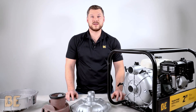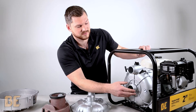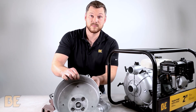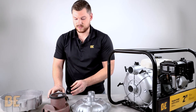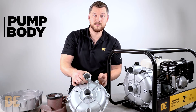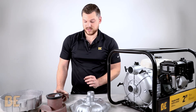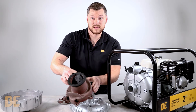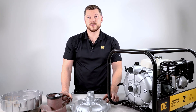Semi-trash pumps are designed to pump large volumes of water that may contain rock or debris, and can be easily identified by the black t-bolt handles that hold on the front pump body. Here we have some of the internal components starting with the back joint, then the impeller, the whirl case or volute, and lastly the pump body. Each of these materials is designed with extra reinforced thick metal, including a cast iron extra thick impeller and a cast iron extra thick volute, which allows water and debris to flow through simultaneously. This also applies to the three-inch semi-trash pump.